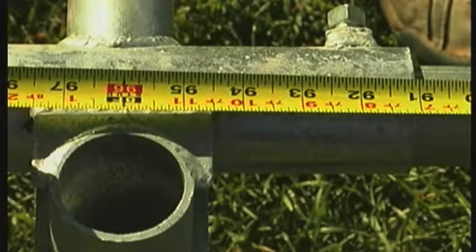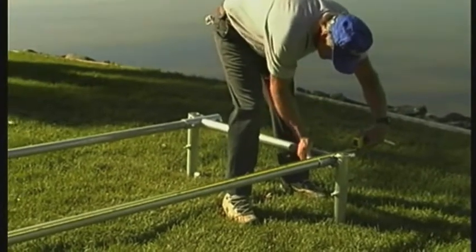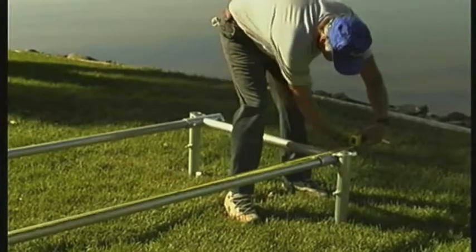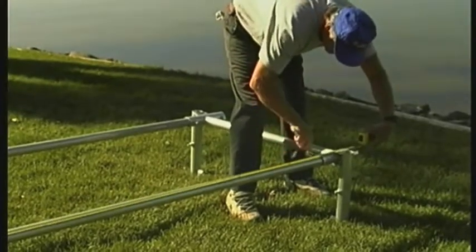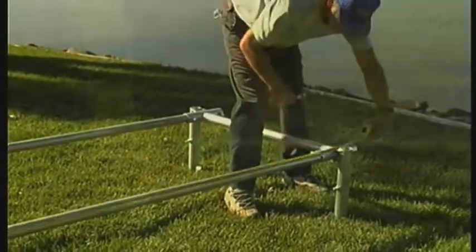To position the second continuous bracket on the 16-foot framework, it is crucial again to be on 8-foot center. Extend your tape measure from the stamping on the bracket that is already in place 8 feet to the same edge of the stamping that is on the bracket you are currently installing. Also, be sure the set screws are facing back toward the open end. If the 16-foot frame pipe has a slight bow, be sure to position the pipe with the ends drooping.